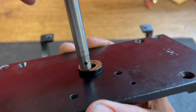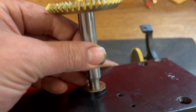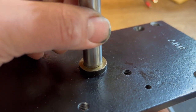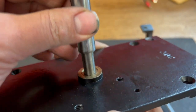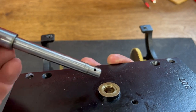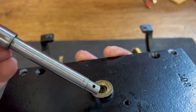There's still enough clearance that the clock runs, but it pulls this gear down so the teeth don't mesh as far as they usually did. It also creates a whole lot more contact surface — with the surface tension of the grease it actually sticks a little bit. So we need to do something about this. It's not really practical to fill it in, so the choices are basically to mill this flat and then put a brass washer on top, or to try to fit a brass washer to this inside dimension.